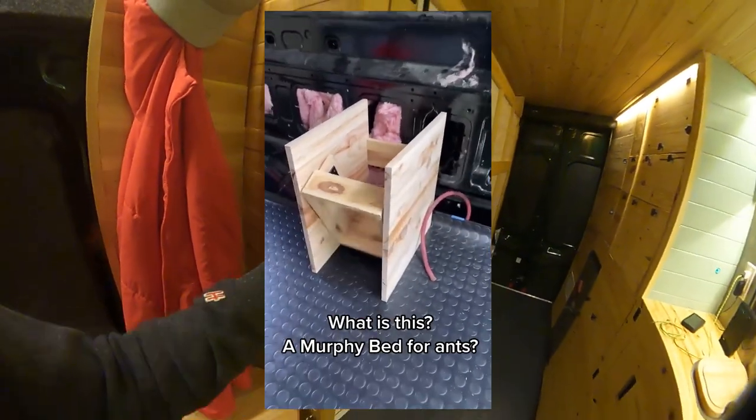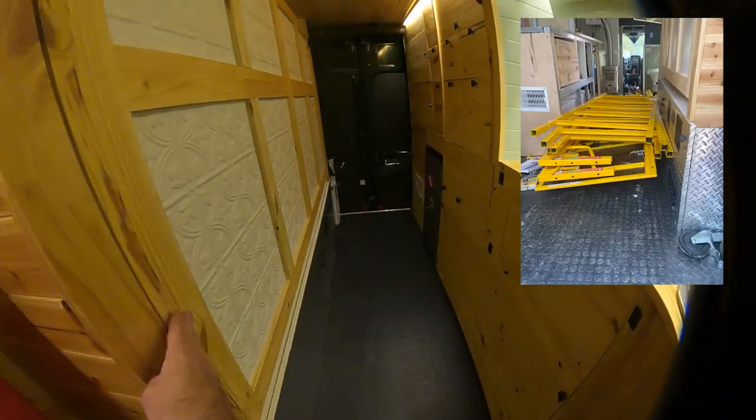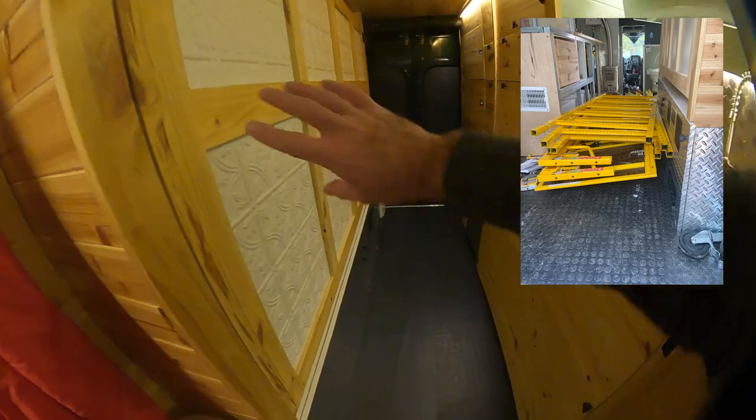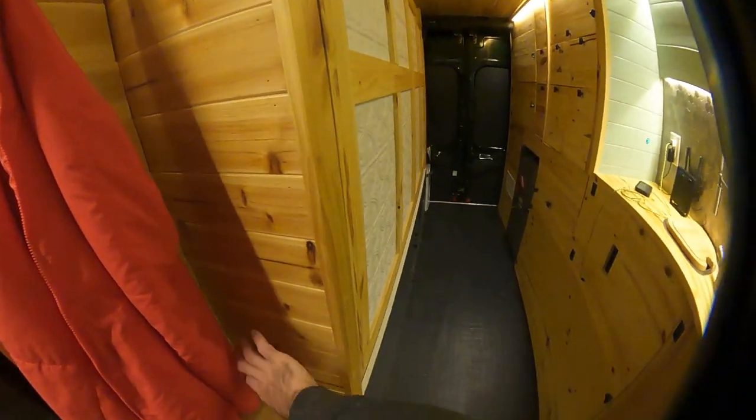So if this bed is 46 inches, this space here is about 32 inches of clear space, and the bed pivots out — some of it stays behind this wall because of the hinge. The hinge makes this thing work. The kit is really just pieces of paper with the dimensions of a bed. I bought the dimensions for a twin bed and modified it for my application because the mattress I got is a custom size — I think it was on Mattress Insider. It's between the size of a twin and a full, but it was a size they offer.